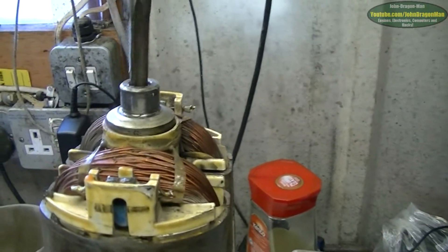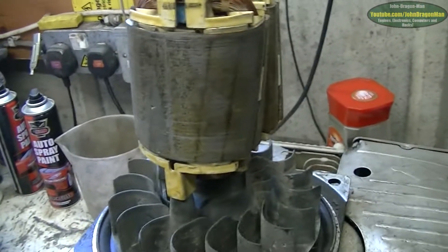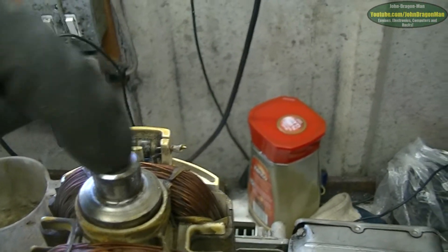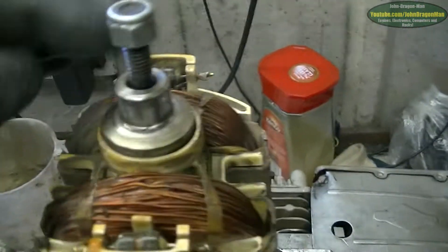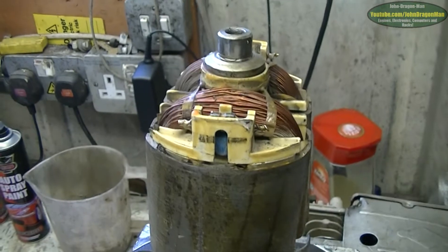A bit of a tight spot here — no way of pulling the actual armature off the engine. So I looked online to see if there was some special tool required, but apparently not. There's a guy on YouTube — thank you very much Donnyboy73 — for showing how to get this off. You put a thread in there, use a bolt, then put another bolt with the head sawn off, slightly bigger than the thread, which slides down into there and screws on. You use that to push it off. So we'll see how it goes.